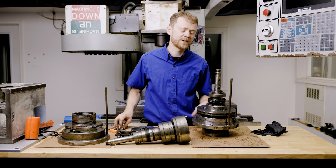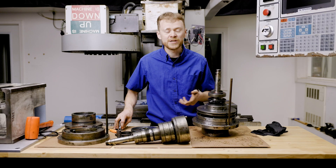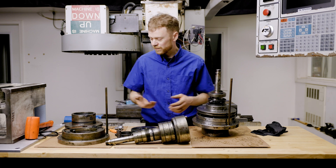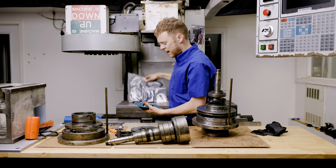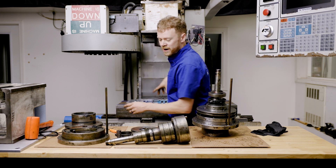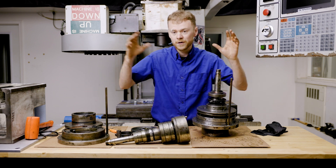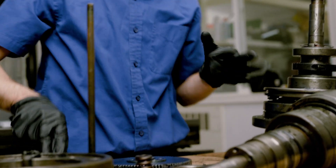This is on machines that run three shifts a day. This one was a 12-year-old machine and it ran hard. You can just replace the whole piston, or you can rebuild it with a rebuild kit. Before I do this, I'd probably replace the valve and the quick exhaust valve. The air comes in here or comes in either in the casting here — that's how that works. Let's tear into what each piece does, and I'm going to put on some gloves.